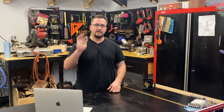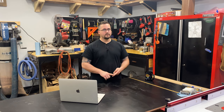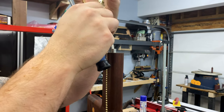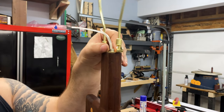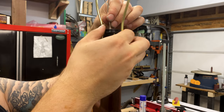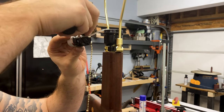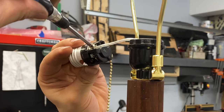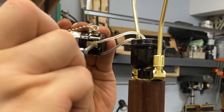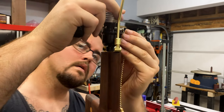After everything was dried up and finished I had a 3/8-inch threaded rod — this comes from the lamp or lighting department at your big box store. In fact all of the lamp hardware I got was from the big blue box store. Lamp wires are super easy — just make sure when you're doing this next part the lamp is not plugged into any source. Your neutral wire is generally identified as having a rib on the side; when you feel the wires, one side has a really prominent rib and the other side is nice and smooth — the smooth side is your hot wire. On the socket itself your hot channel is closest to the actual switch, whether it's a pull chain, twist knob, or whatever it may be. All you have to do is unscrew both screws at the socket, make a little J-hook on the end of your wire, and screw that down where the screw actually holds the wire in place. The rest of the socket assembly is pretty straightforward — screw everything into place, plug it in, throw your bulb in, and check to see if it works.